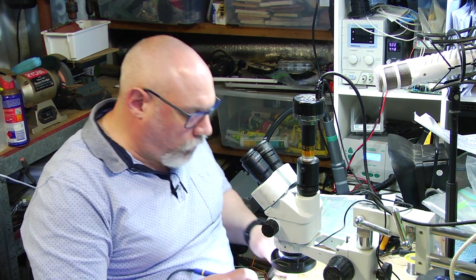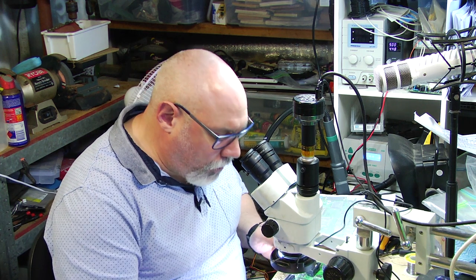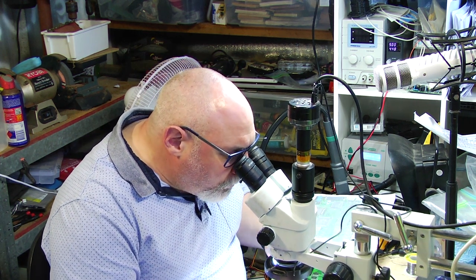I'm just going to flip this around the other way. Sorry about that. Zoom, zoom. And I'll just demonstrate that when I do this side here. So I'm going to hold that in position. I'm going to try and make it match up position of the other one. And I just do it like that. So you see how quickly I ran that across there? The solder melts really easily because I've got it at such a high temperature, but I don't let it sit there. And that's one of the ways that I get these really nice, clean joints there.